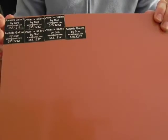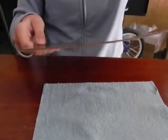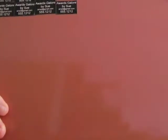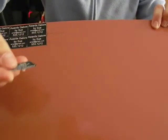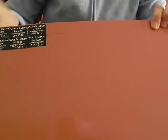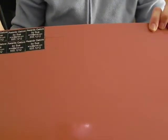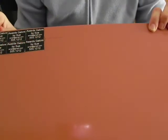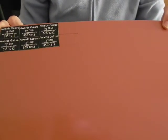After the laser lights have been engraved in the laser, I removed the Multimat from the laser bed, and you can see that these items that were engraved still stick on here. They're not going to fall off, and the adhesive does not ruin your substrate. The items will come off easily when you want to take them off, but they will stay on here when needed, so you will not have any pieces of engraved material going into your exhaust or flapping up in the way of the lasering process.